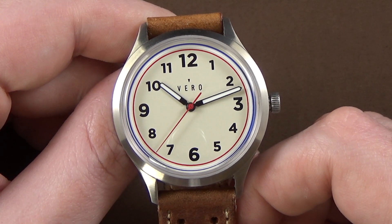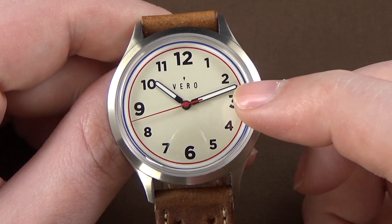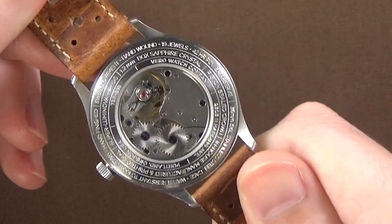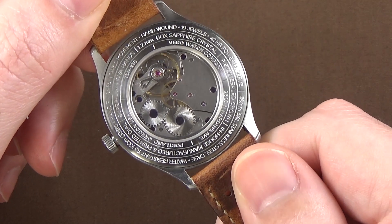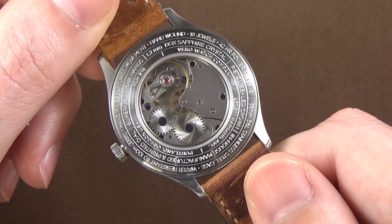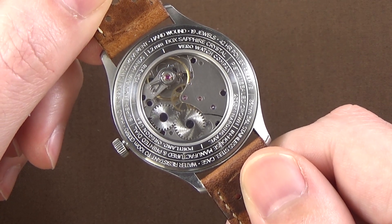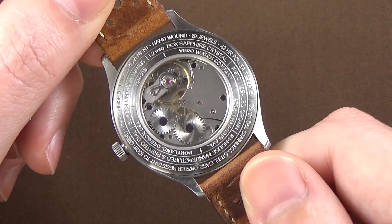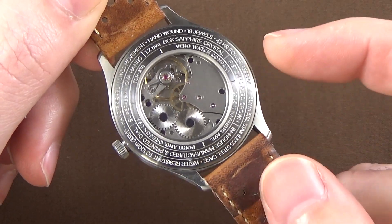The handset is very nice as well — high-polished black oxide stainless steel with a little bit of SuperLuminova on the hour and minute hands. The movement is really nice: it's a Sellita SW-210, which is basically a hand-wind-only version of the SW-200. As installed by Vero, it is highly regulated — regulated in six positions to plus or minus five seconds per day. Don't just gloss over that; this is a very highly regulated movement, and that comes with a price.